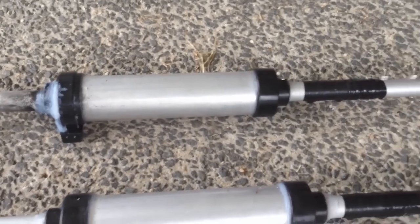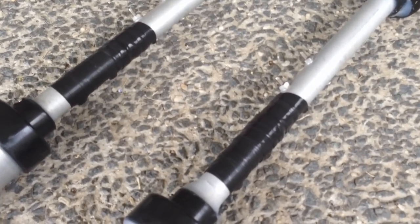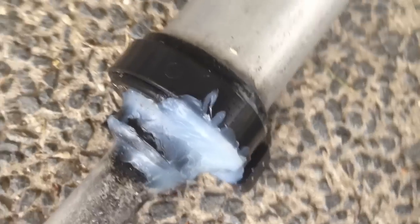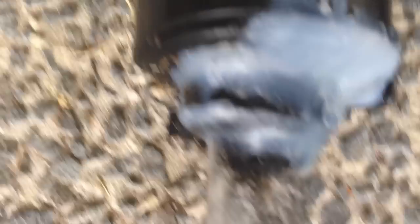So I had to do a fairly ugly looking mechanical repair and then went on to seal off all the end caps with silicone, and we've got some tape. Some of this is self-fusing silicone tape and some vinyl tape, just to waterproof the whole thing the best I could. It looks like it arced across the capacitor in the trap that's formed from the outside sleeve to the next element.